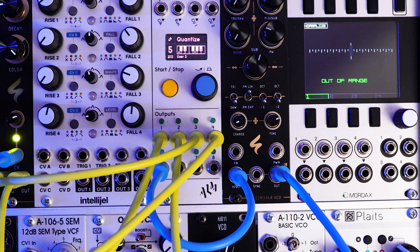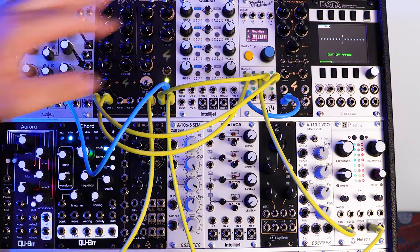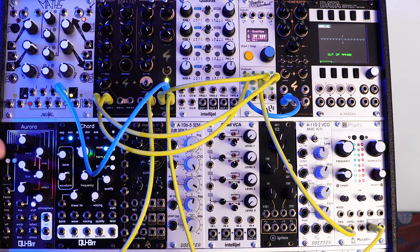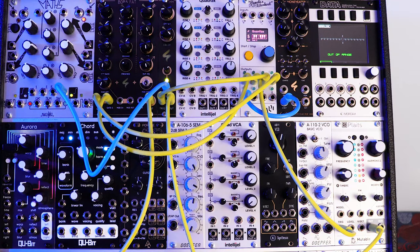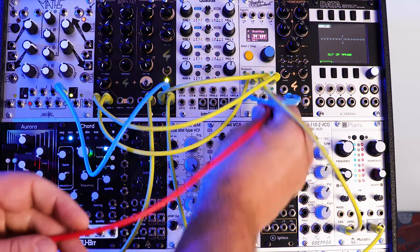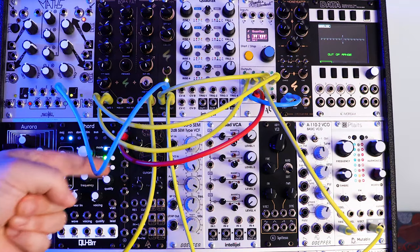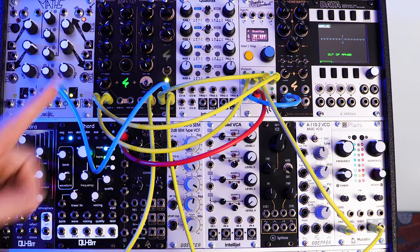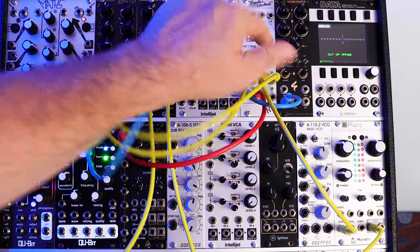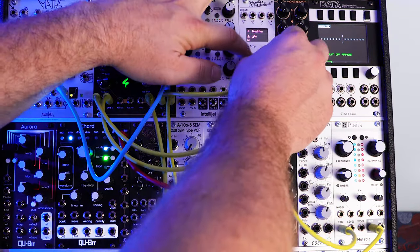Let's set up the rest of this voice. As I said before, we're going to need two different envelopes — one controlling the gate of the voice and the other controlling the filter envelope. Since we're going to use output six as our gate clock source, we're going to have to multiply it. We'll come out of output six and go into a multiple — which is actually another AI Synthesis DIY build. You can watch me build it in the link in the description. We'll go back to number six and set it to times four, so that's going to be playing 16th notes.